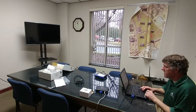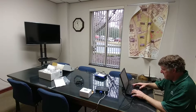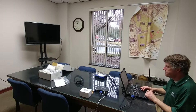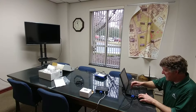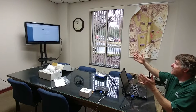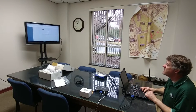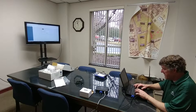I'm logged into the router and I can see that the Crestron device has an IP address — let's see if we can log in. I can see 'HDR x201' in the list. Now I'm going to push video from the laptop over VGA — and voila, there it is. You are now seeing my display up on the screen. I'm logged into the Crestron web interface — the default login is just admin/admin.